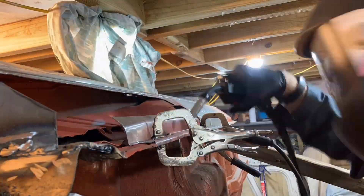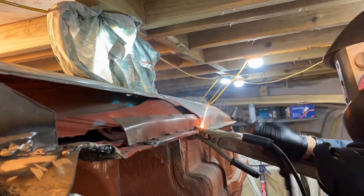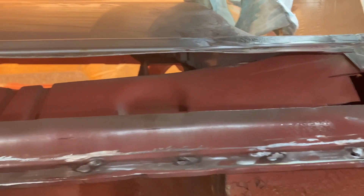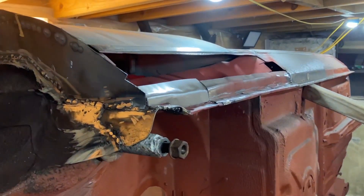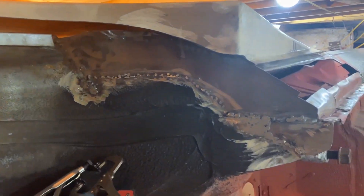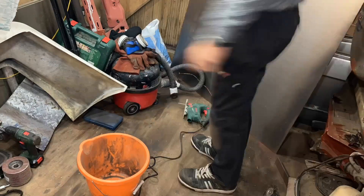You could do it all in one piece but it's going to be quite a big piece to get into the vise. On the normal fiberglass kit I've got, people normally cut all this off and don't have anything there and just use the fiberglass, which I really don't want to do. So I'm trying to get some strength back into it by cutting the rot out and putting new fresh steel in, welding it onto clean rust-free areas. I just wanted to check that the fiberglass panel would still fit afterwards and it did.